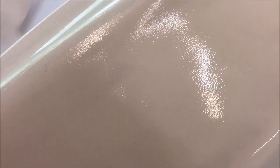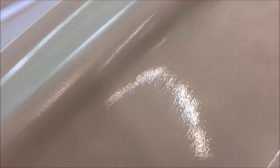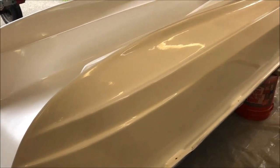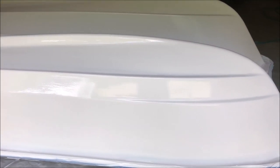The solution for the orange peel was I needed to go ten percent thinner but I chickened out and only went five. Luckily the boat needs two more coats of paint — I'll wet sand it with 320 and spray another coat with more thinner, then put on a third coat to make it satin. I wet sanded the whole thing and there it is with the second coat. That's four finished coats and two coats of primer. It came out a lot better than I probably thought it would when I started — it's a little glossier than I'd like, but there's just a tiny bit of orange peel under the last couple coats. All in all pretty good for an amateur.